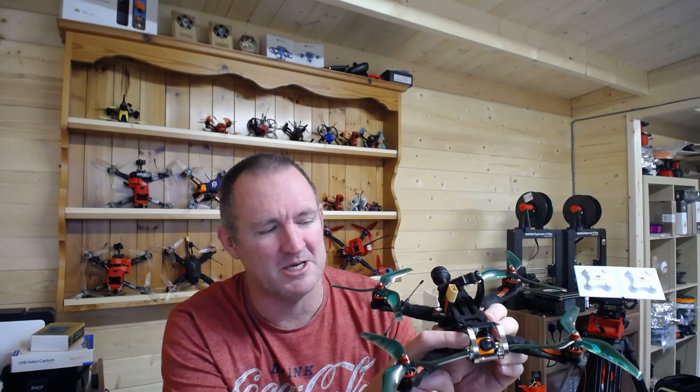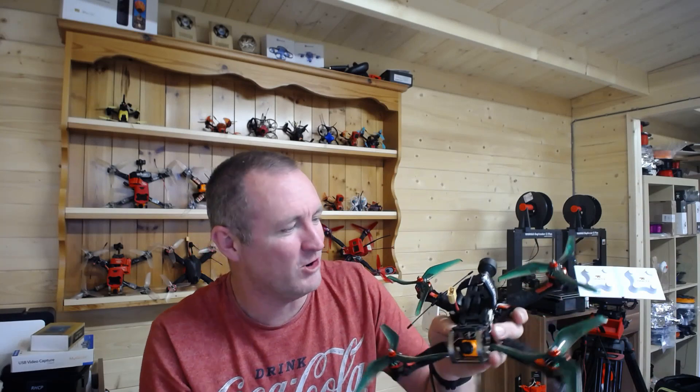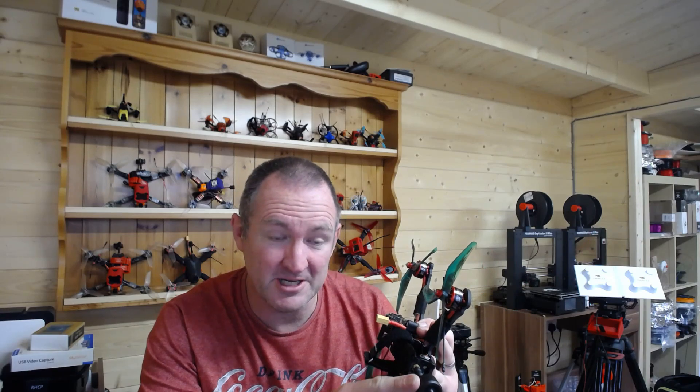There's a little adapter board you can plug in, which you can then use to tune the camera and set things like the VTX channel. You've got a little RunCam HD camera sitting over here. Unfortunately I had to print a little 3D-printed adapter because the Chameleon here isn't really built for taking a camera that small, but it works. You've got an absolutely standard form-factor VTX board — it pops in, it works, takes a standard 5.8 antenna on the back with an MMCX type connector.